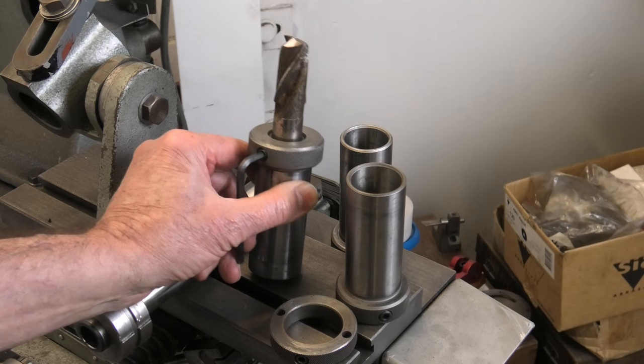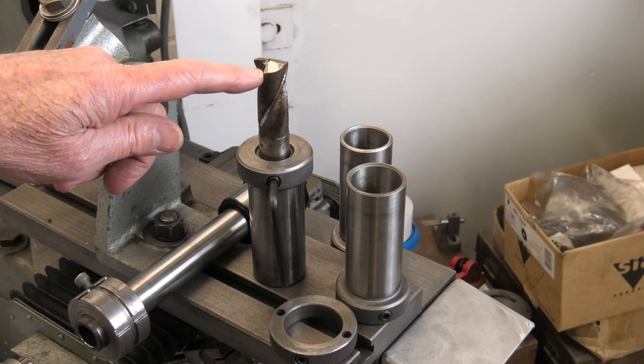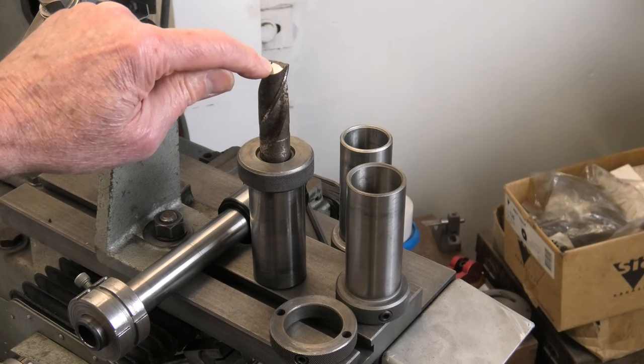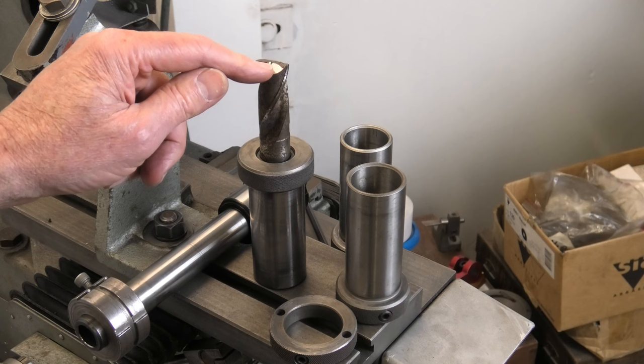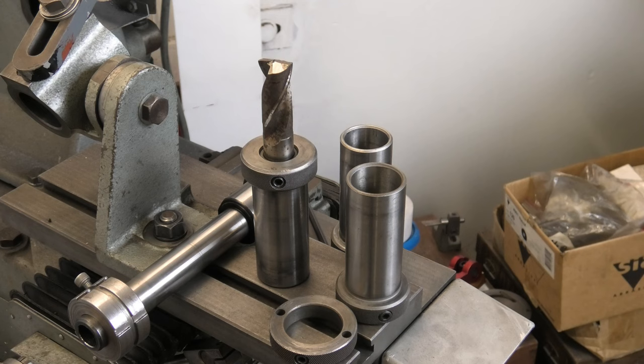The next grinding job is to come in here and grind the relief, or the third clearance, so that the secondary clearance doesn't have to be ground back so far. It is possible to grind this at the moment, and the secondary would work. I've ground past the gash in the middle, but I feel that if this part is ground up a little bit better, the whole cutter will work better, especially end cutting or plunging in the middle. It pays to get the grinding of these facets done properly, and I'm still figuring that out. I could just go up to the bench grinder and hand-relieve it back past the notch on both sides, but I want to try and do it on the grinder and pass through under a Type 1A1 or a plain wheel, the way they would do it in the factory. That may not get done this weekend, but it's a bit of a realisation of why this poor old thing vibrates so much — it's partly me, and partly it's a little bit flimsy.